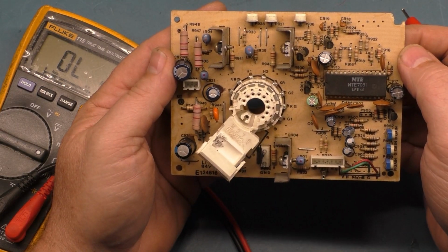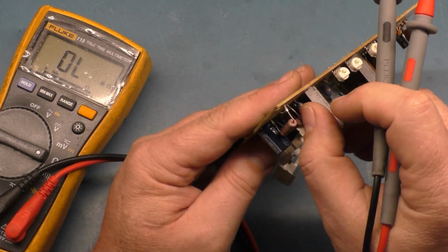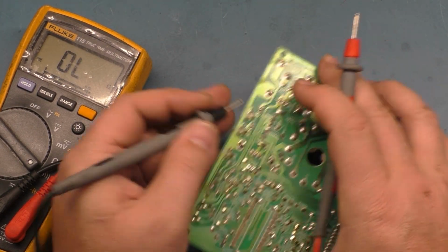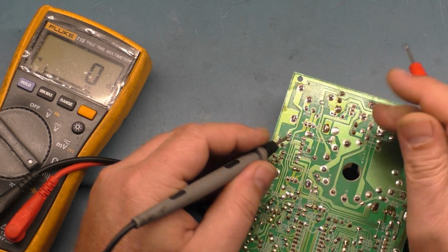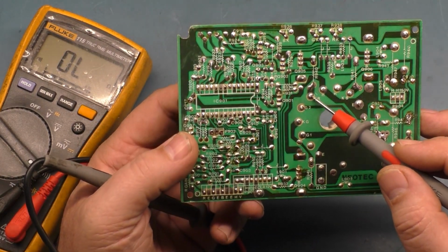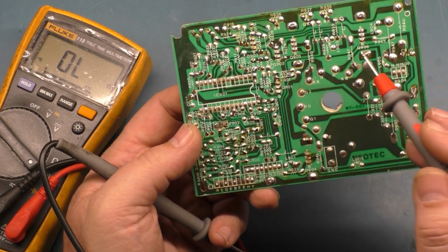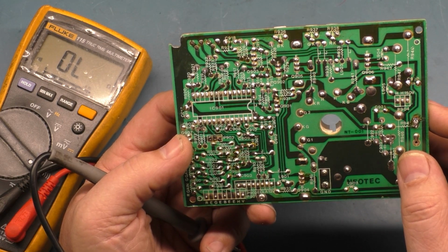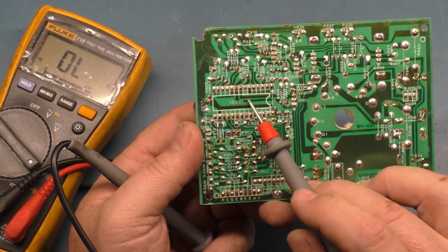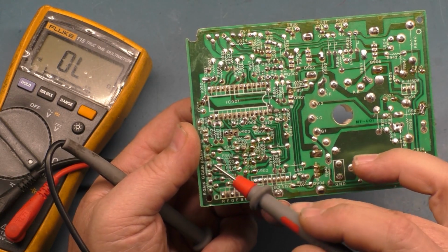Well, I've never seen the inductors be bad. We can test those with a quick continuity test. 904 is good. 903 is good. We know green's okay. 901, yeah. Solder on the next socket is okay, but could be touched up. It's not an issue of having bad solder on the transistor. And I'm wondering if it's the RGB encoder chip. I don't see bad solder on the pots.